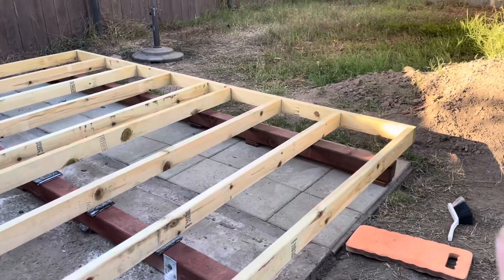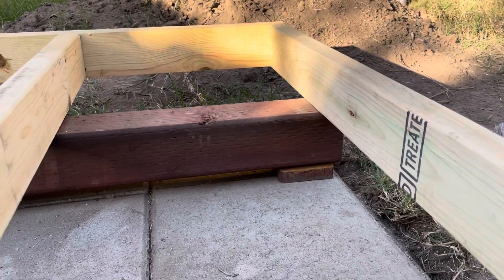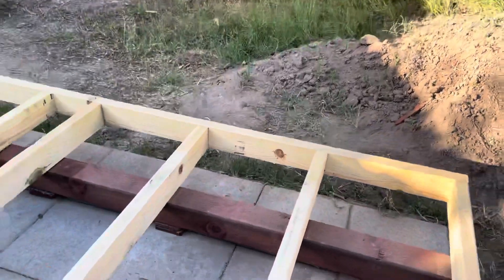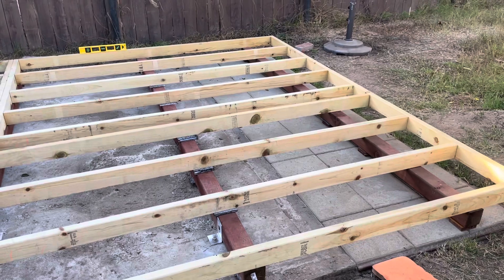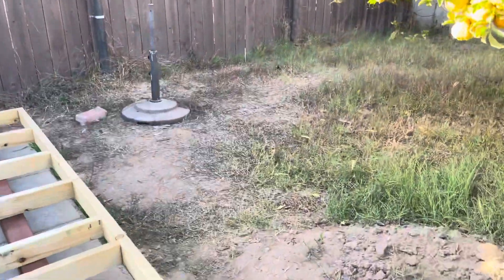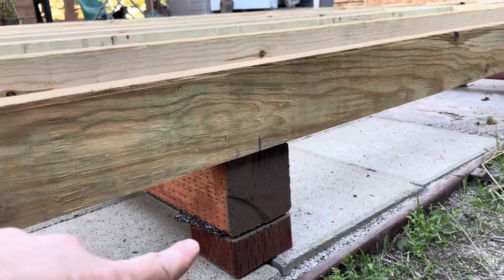This last one is raised the whole way. For leveling, I cut pieces off the treated lumber — here's an example — and I made sure to treat the cut side with waterproofing stain, because those are incompressible. What I did first was use pieces of shingles stacked up instead of wood pylons, to get it leveled and figure out how thick to cut my wood pillars. I didn't want to leave shingles on the ground because moisture will degrade them faster than treated lumber. So I used shingles to level it, then cut wood pieces of the needed sizes — the biggest are about one and three-quarter inch — and swapped out the shingle piles with the wood pieces. If I need any fine leveling, I added shingles in between so they're not touching the ground.